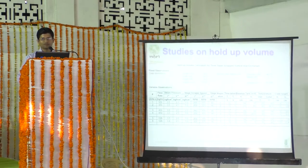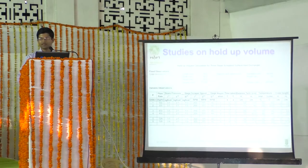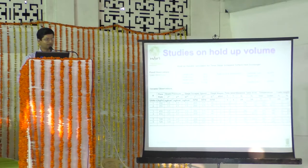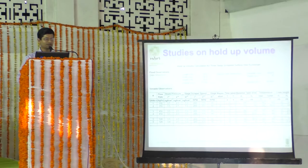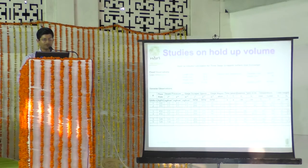With this concept, the hold-up volume of the existing equipment was studied using three higher flow rates: 350, 450, and 528 kg per hour of water, while keeping high steam pressures and scraper speeds. Steam pressures were kept at 3.5, 2.5, and 1 kg per cm² for scrapers 1, 2, and 3 (stages 1, 2, and 3) respectively.